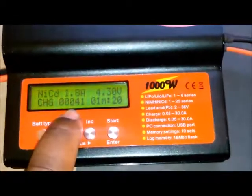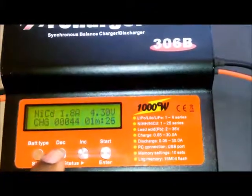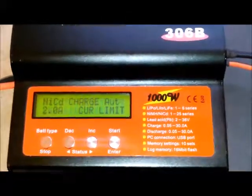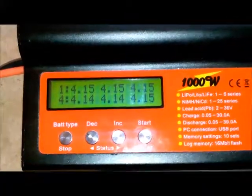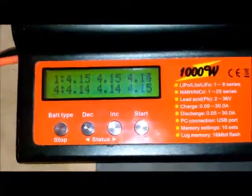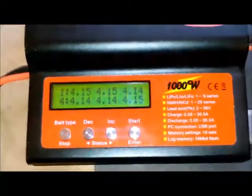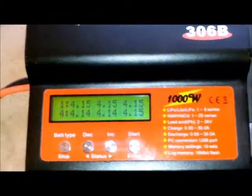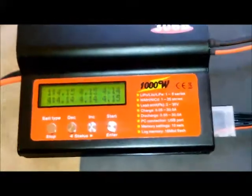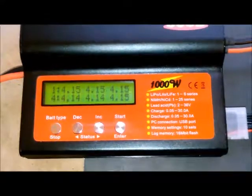I'll go for 45 mAh. Stopping and checking the balance on the pack one more time. Look at that — the dead has risen! We finally got that cell up to 4.15. I've been trying to let the charger do its magic and get that cell up by itself, but it wouldn't act right. So we pulsed the cell three times, put in about 100 mAh into that one cell, and it finally got the cell back in line with the others.